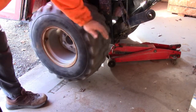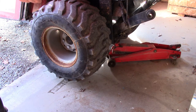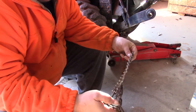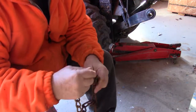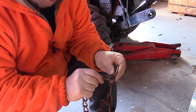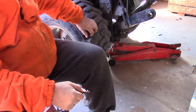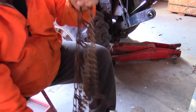I've got the back of the tractor jacked up, so now I can get at the back wheels. The chains for the back wheels are the same sort of deal as the front, except there's no ice picks on them — so as long as I get the disconnecting link on the outside of the tire, there's no left or right to those ones. There is a top and a bottom to them though. These are the cross links — the connecting links and the cross links turn up. I like to put these facing upwards so they have a chance to catch in the snow and ice, plus it's not digging into the crown of the tire. I don't know if there's any rule about that, but that's what I like to do.